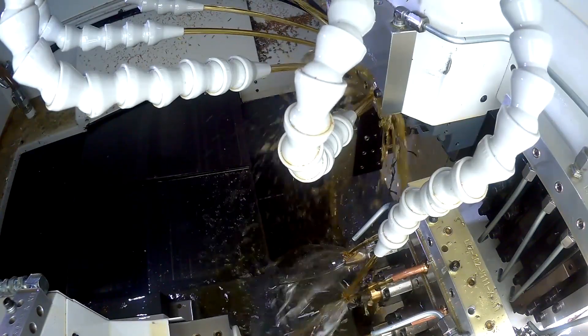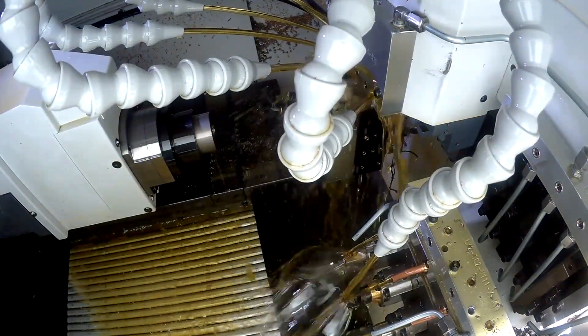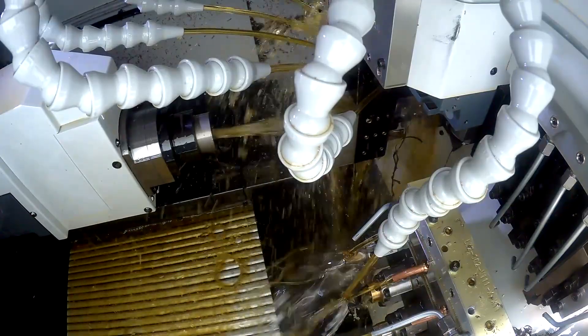So in the actual envelope of the machine, what have you got in there? We've got 7 driven tools — face driven, cross driven. We have a manual B-axis for angled cross driven, tapping, drilling, multiple drilling, and the LFE obviously. So in there you've essentially got a load of tools that enable you to do some really complex components.